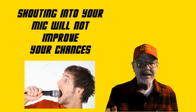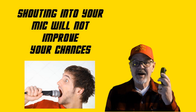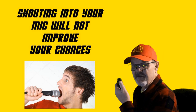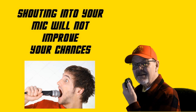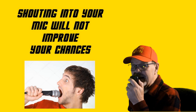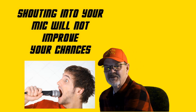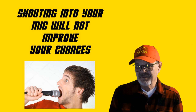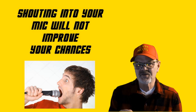Again, the exact opposite of what you really need at the moment. The proper way to hold your microphone is to hold it two to three inches away from your mouth, speak in a calm, relaxed voice, and speak across the microphone instead of directly into it. Training yourself to properly use your microphone will lessen your stress, make operating more enjoyable, and in the end, increase the number of QSOs you make.